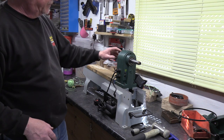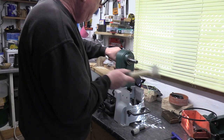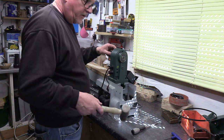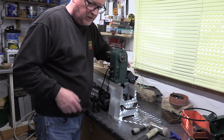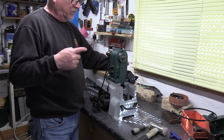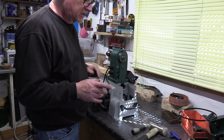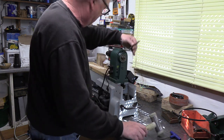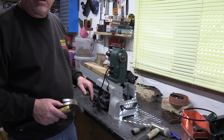And then it's down to brute strength and ignorance, so to speak — I've got plenty of that. So I've got so far there. Don't forget you've still got that collar inside. On this one it's a shouldered sprocket that goes around there and the shoulder is facing towards the bearing. If you're not sure as you're going along, you've got your manual and there's an exploded drawing in there. But what you can also do is get a piece of paper and just draw it off as you take it off or make notes as you take it off so you've got the procedure.